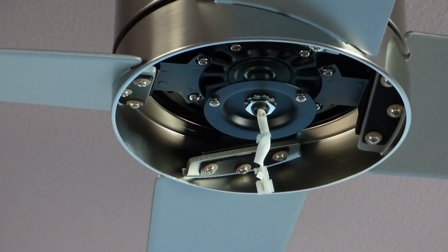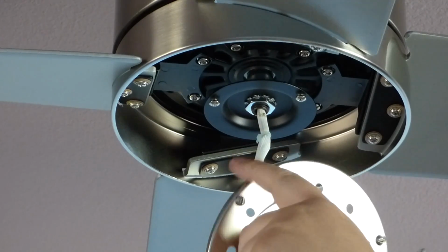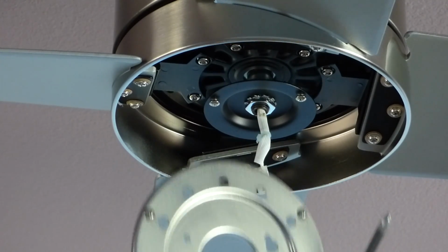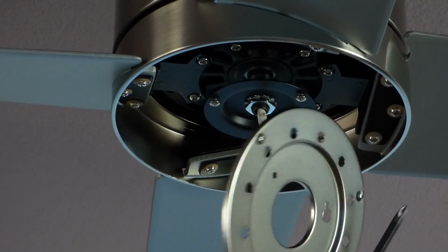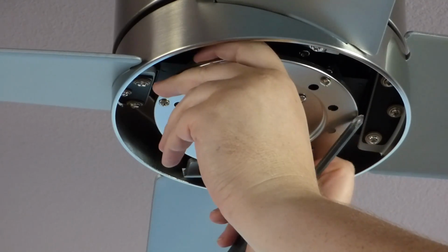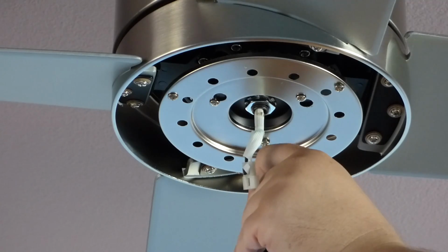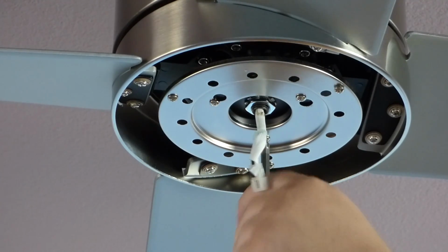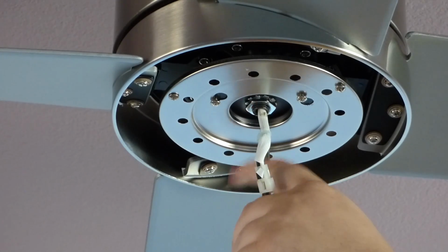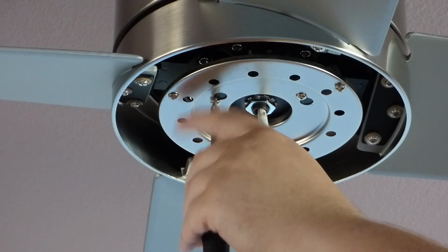Okay, so that put down there. Meanwhile, this right here, the plate, you notice there's screws already in it. And what you're going to do is there's also holes, two slotted here and 1 knot. So this goes with the wire in the middle, and this plate goes over the screws that are there. Give it a twist, and you should be able to put the screw you took out back in, thus locking that plate in position. Snug it down tightly, and do the other 2.